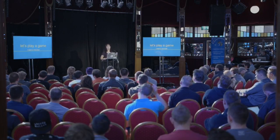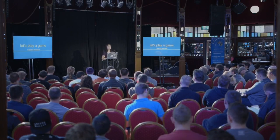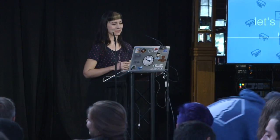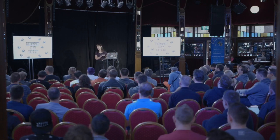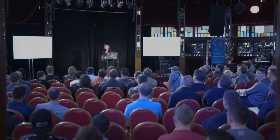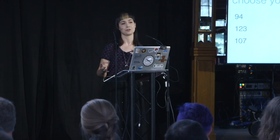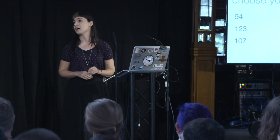Well, I want to show that really quickly. We are blazing through our time. I need a volunteer. You don't have to get up on stage. Emily, okay. All right, Emily, we're going to play Brick My Chip, okay? You need to brick my chip on stage. This is a fun one. Okay, awesome. I want you to choose the correct fuse. Fuses are settings on chips that allow you to set the clock speed and whether it has an internal or external crystal and things like that. I want you to choose the fuse value that will brick this chip.